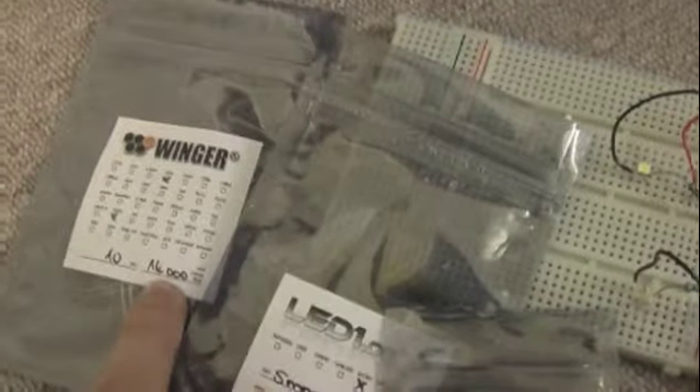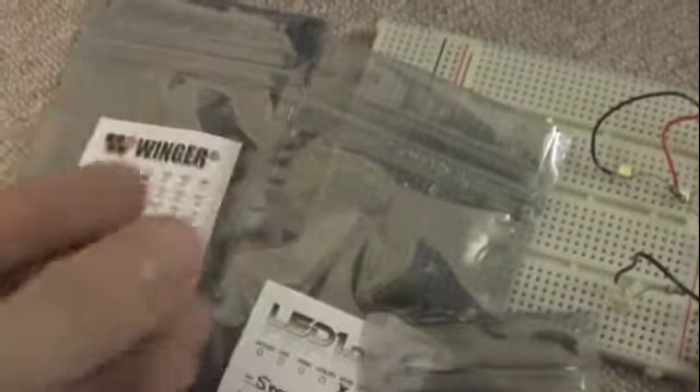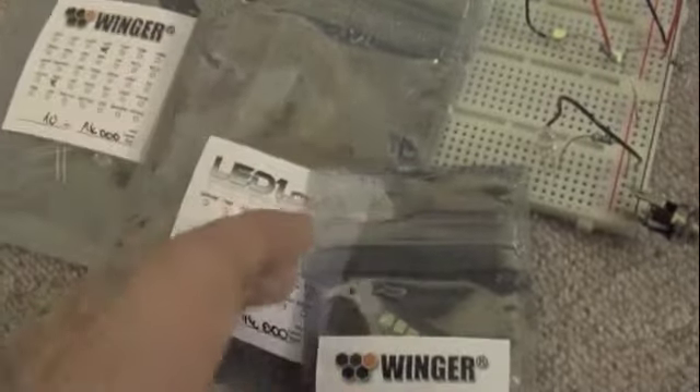So I went online and picked up some LEDs — I've got a couple of 5mm ones here. The ones that were in there were 12,000 MCD, so I've got some 14,000 MCD ones. These 14,000 ones are also more interesting because the beam angle is 40 degrees, not 20, which means hopefully the light is spread a little bit more. This one was a ridiculous 44,000 MCD but the beam angle is only 10 degrees, so it's probably not going to shine much anywhere.